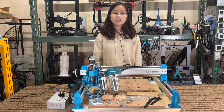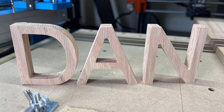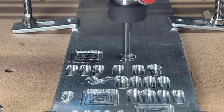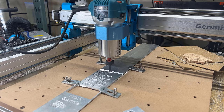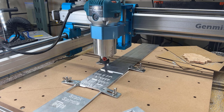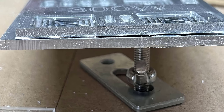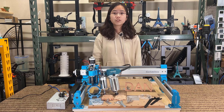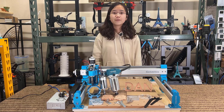In conclusion, I believe this machine is an excellent value for its price point. If your main materials are wood and acrylic, then the stock setup will work just fine. However, if you're looking to work with aluminum and cut everything faster, I highly recommend upgrading to a $100 Makita router and a $30 aluminum spindle mount. With this setup, you can cut aluminum at 200mm per minute with a 0.4mm step-down, which is quite fast for a budget machine. Additionally, this machine is beginner-friendly, making it an excellent option for those looking for their first CNC router or an upgrade from a CNC-3018. I included a link to the machine in the description. If you found this video useful, please consider giving us a like and subscribing to our channel. Thank you for watching, and I will see you next time.